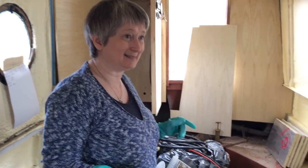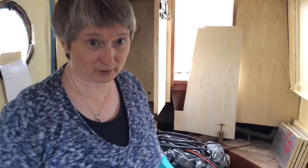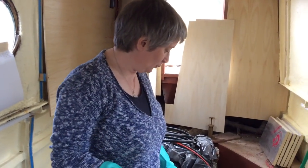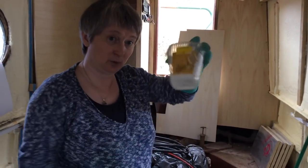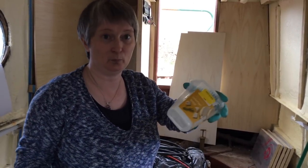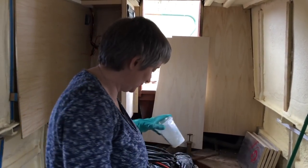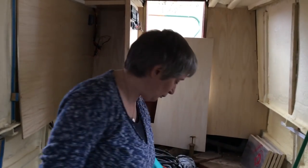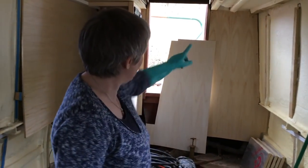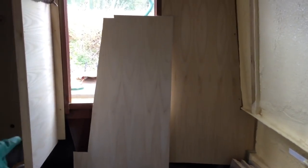So what we're now doing is testing what happens when you dilute the wood stain with a varnish. We have, in this little pot, tested 1:1, so 1 spoonful of white wood stain to 1 spoonful of varnish. These are both water-based products. So the varnish is clear, the wood stain is white. That's what the varnish looks like. That's what the wood stain on its own looks like.